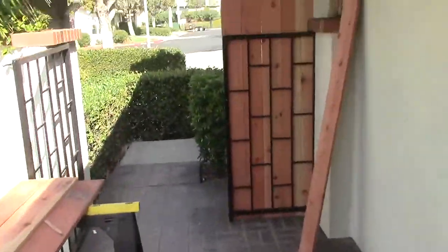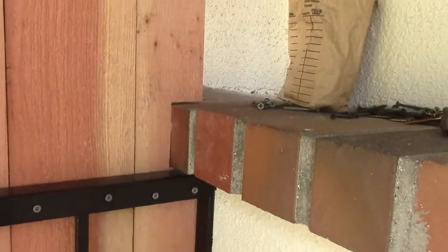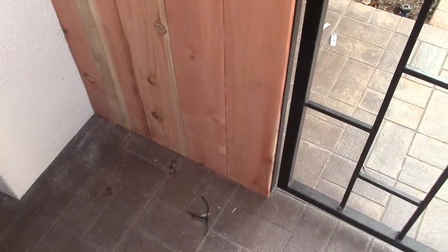Out here, they had an old entry gate with just a gate. What I did was attach wood dog ears right to the iron gate — notched that out there for that. It's strapped at the bottom and the top. You've got to leave some space at the bottom for drainage to go through, which is very minimal. On this gate, we'll be putting those panels there as well. One of the things you've got to remember is you've got to make sure you're going to have clearance here. When you swing the gate, the boards on the gate have to be much higher than the boards that are static and don't move, so you get your swing across the bottom and they don't bind up on anything on the flooring. Because there are some issues on the tile floor.